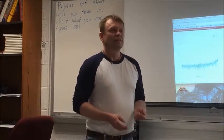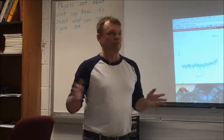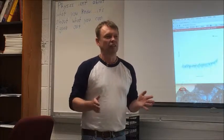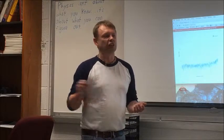So does that wind up being stochastic noise? No, it's just phase difference. Because when you go through the amplifier and back, you have delay. And this translates into a phase difference when you change the frequency.